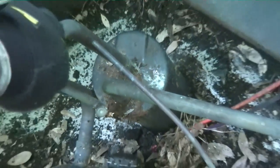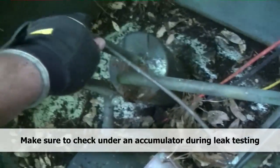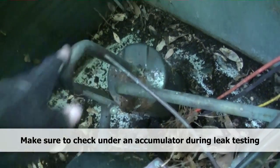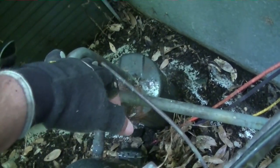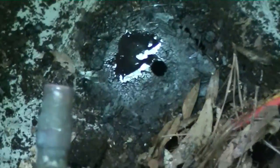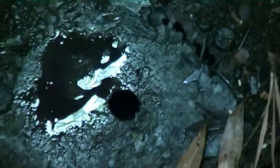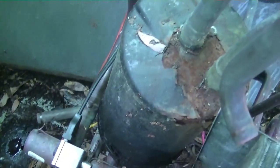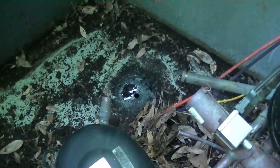Alright guys, the evacuation is done — wasn't much in there anyway. You can see the rusted top on this thing. It was leaking pretty heavily in between the two pipes, you got a really strong reading. The bolt on the bottom is rusted out too as far as the seat for the accumulator. We can cut this one out and put the new one in place. The accumulator has been removed. You can see on the bottom there was oil residue and some oil actually standing right there where the accumulator was leaking. This sucker is definitely done, but it's been in there for 17 years, so pretty good for an accumulator.